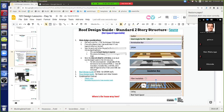Wes has got that. The fiber insulation goes into that, once we're building it. On top of that, we've got an insulation box for the rigid insulation, 4 inches of it, which goes inside the insulation box. So we're going to trim a little bit off the rigid insulation edge because the frame is on the inside and constrains the insulation. It becomes 1.5 inches smaller, because the outer insulation box frame is still 16 by 32. Everything we're doing is 16 by 32. Pretty much think about it that way. And then OSB goes on top of that.